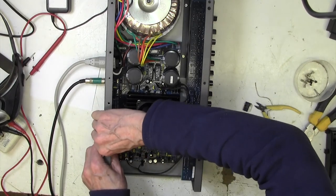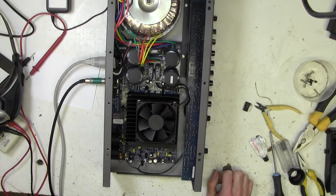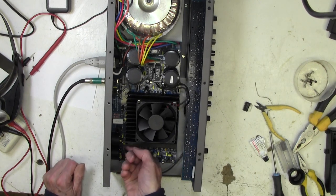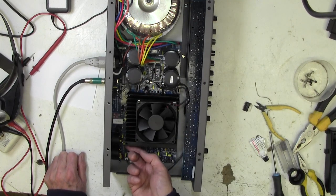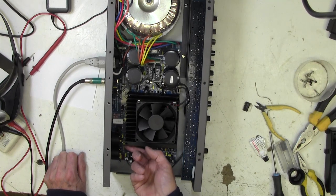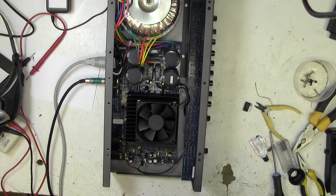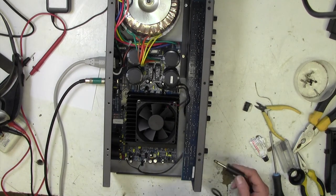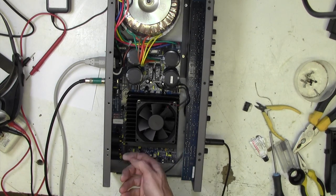Right, so we are turned on. I'm going to turn up to the absolute minimum, which is 40 volts. I can put my fingers in here because I'm nowhere near the mains, and we're only talking plus or minus 50 volts or something on these chips. I think I may as well put a signal in as well, although we're not using this part of the amp, just to make sure the thing is working still. So we'll plug in here. From memory, we don't start to hear anything until we get up to about 100 volts or so.